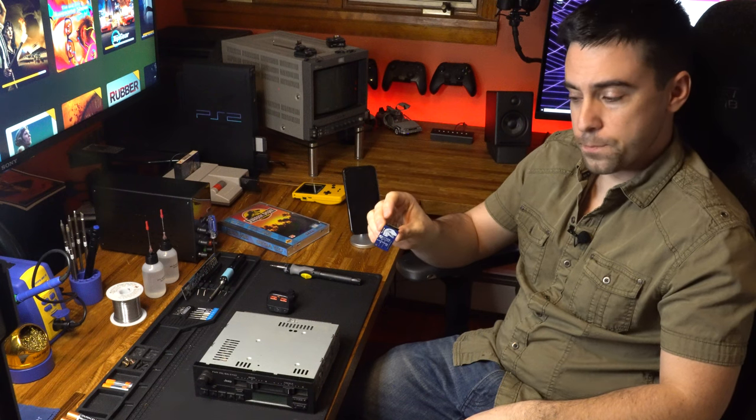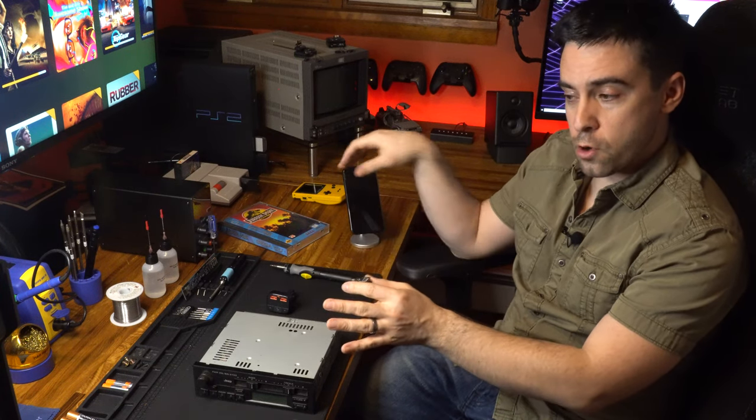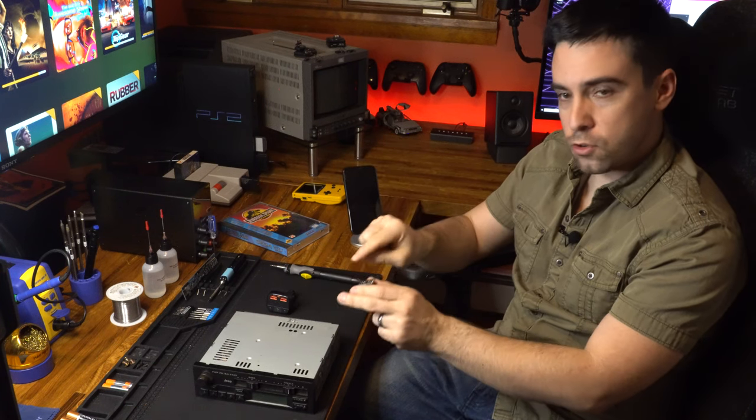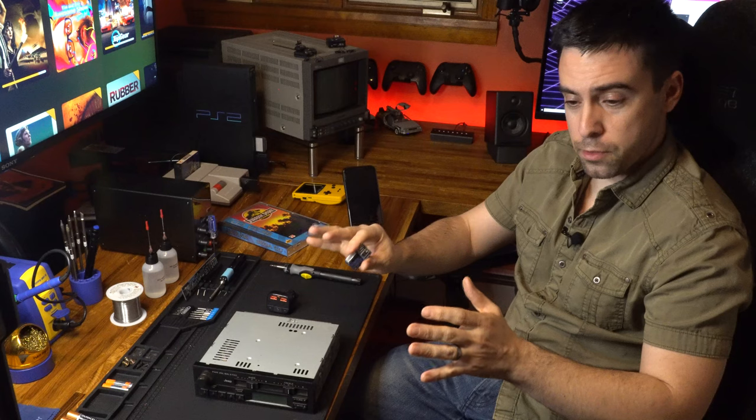The option that I've developed is the Bluestoothilizer. This little board, what it does is once installed, you press a button on the face of the unit and it opens up the audio circuit from the tuner to the onboard amplifier and injects the Bluetooth audio from your phone or other device into the audio circuit. And then you press that same button again and it switches back to the factory audio. It's completely stealth, doesn't require any cutting or drilling of the exterior shell. We're going to install this inside the radio and I'm going to show you exactly how to do it.